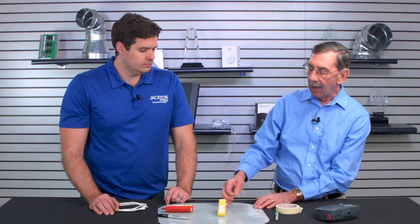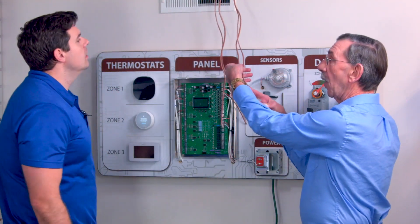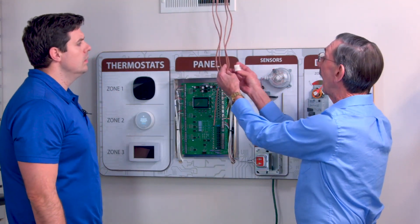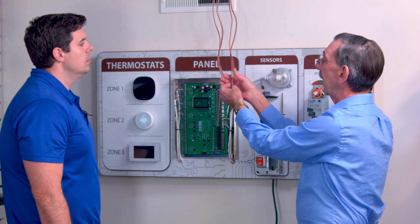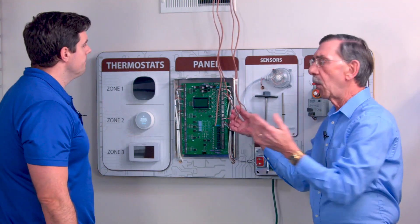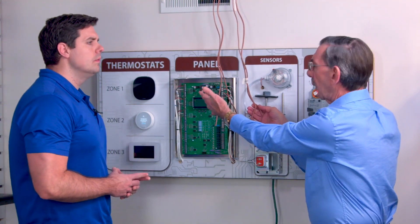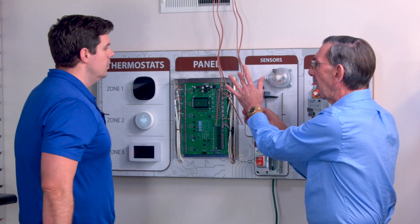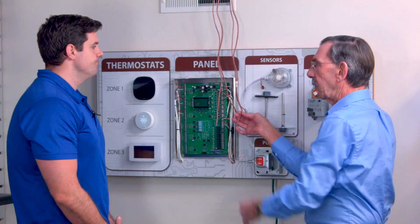That's a good point. Once you get all those things tagged coming from the various zone thermostats and dampers, I recommend you just take a piece of masking tape. Let's say that's ZD1 and this is T1 thermostat — and to make it even nicer, you bundle them together like that. So when I go to land these wires, I know exactly their association with regards to the zone thermostat and the damper that it's associated with.